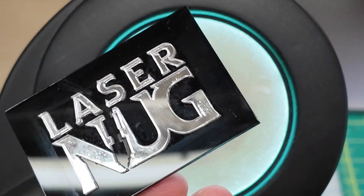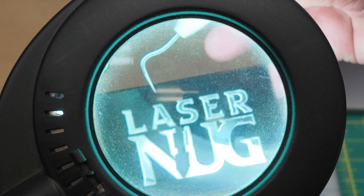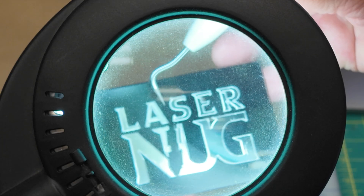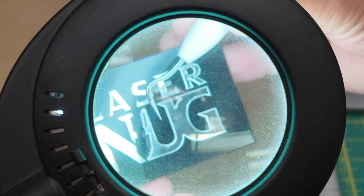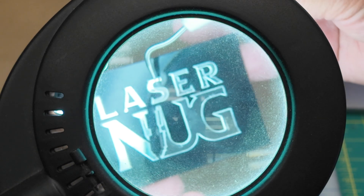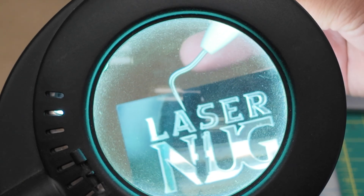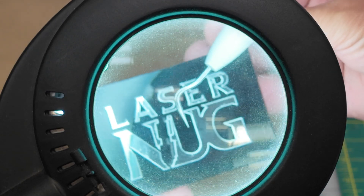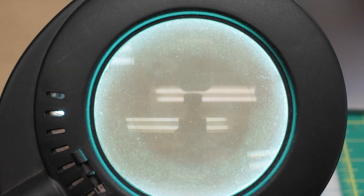A couple of things I did learn though: if you accidentally drip that number 4, don't wipe it. There's a smear mark on the right side of the A because I dripped it there and wiped it off with a cloth. But when I dripped it in the middle of the U, I dabbed it with a paper towel until it soaked up — I didn't wipe. The wipe mark was left, dragging the weld-on across the surface. Where I dabbed it, you can virtually not even see there was a mark. So: if you spill or drip weld-on, it's best to dab and soak it up, not wipe it across the acrylic.